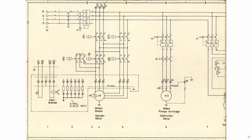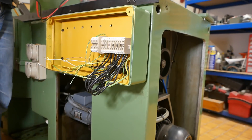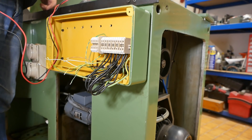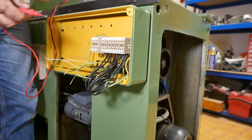These four extra signal wires: two are for the motor overheat switch and the other two are for the brake release. Now I'm not quite sure which colors are which, so let's just quickly meter them. I'm assuming I'll get basic conductivity across the motor switch and a resistance across the windings of the brake.